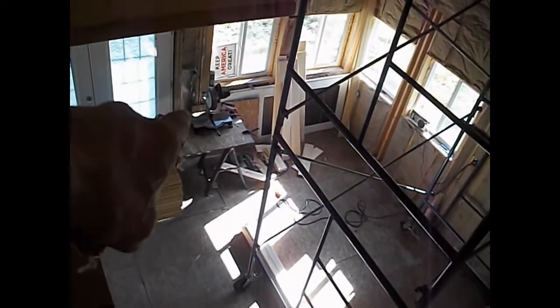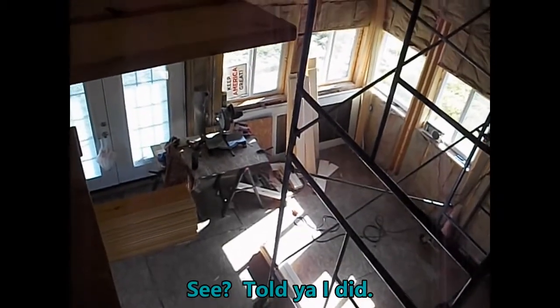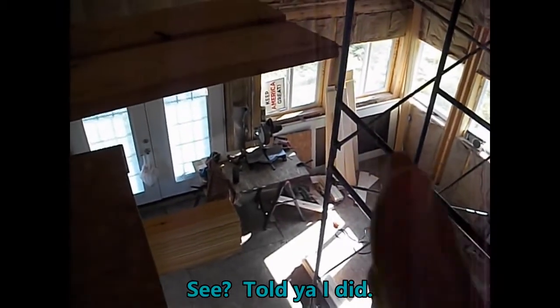Anyway, that's it. I did go to my dad's and got my old miter saw. That's not a compound, it's just a straight miter. It goes sideways, but it won't go this way like my newer one. So I can do the square cuts there, and then go over to the other saw and do that bevel cut right there, like that. And yeah, works out real well.